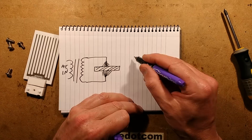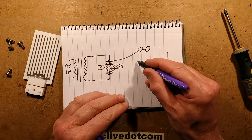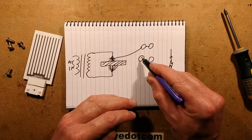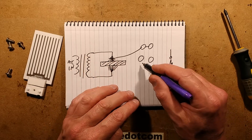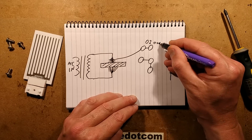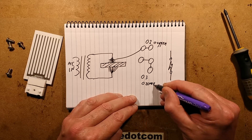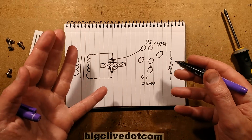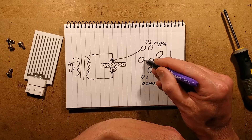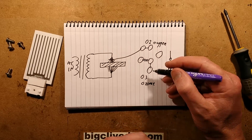Typically, when an oxygen molecule — which is two atoms of oxygen (O2) — passes through the corona discharge, it often gets split into separate oxygen atoms. That's not a stable situation; oxygen in its most stable form is two atoms joined together. So what you sometimes get is three atoms of oxygen joined together, which is O3 — ozone. You also get individual oxygen atoms, and the nature of an oxygen atom is that it wants to bond onto anything it can. Ozone wants to get rid of that third oxygen atom, because it's not a stable molecule and wants to get back to being O2 again.